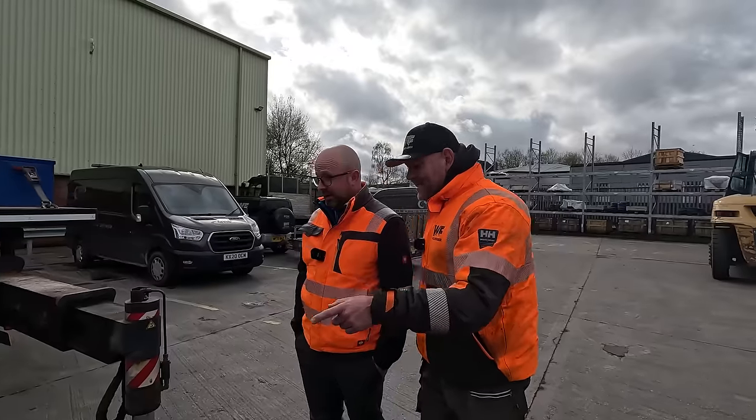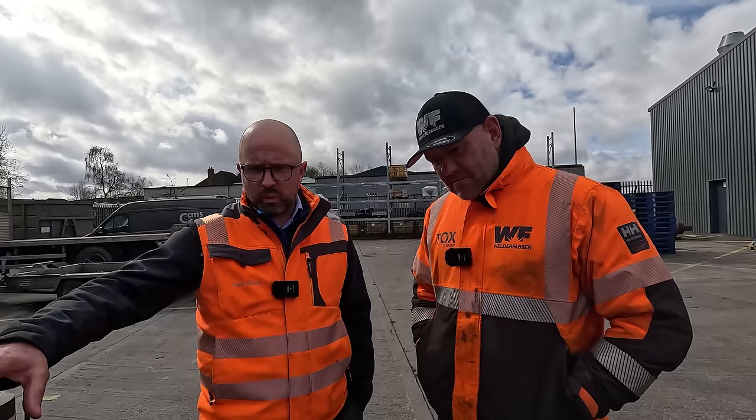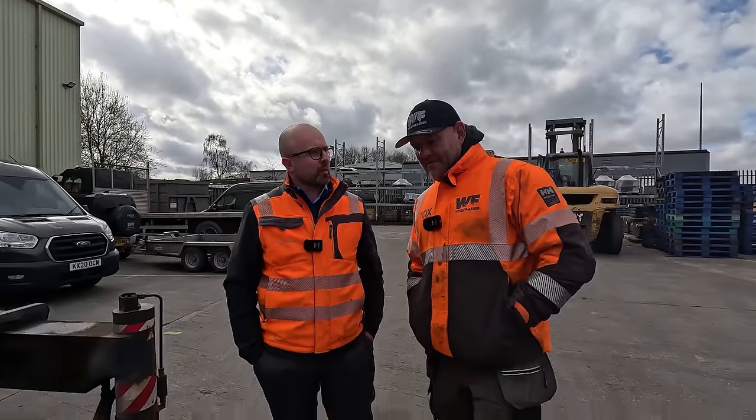So that's 18% manganese. Yep. So that'll be pretty much like what we buy off the shelf from our own suppliers. Yeah, for general wear or general aggregates, general demolition sites, 18%. You would use 14 for more along your lines of your limestones. 21s for anything that's a little bit more abrasive.